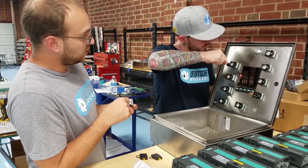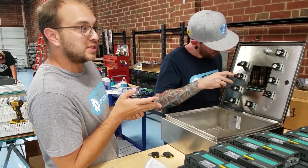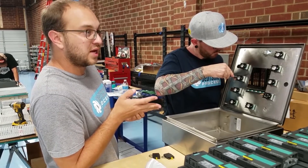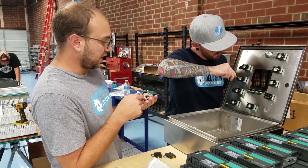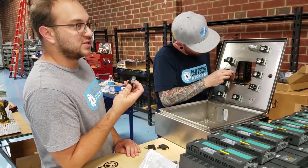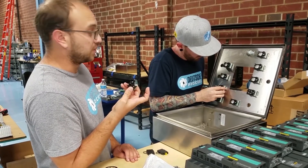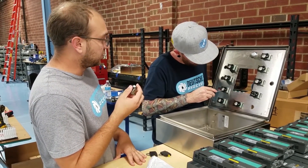The second benefit is you really don't have to key it. With some buttons, you actually have to get a nibbler and key it to know where the center is. But this thing right here actually has a little dot — basically a point that just grabs into the stainless and holds it in place. We've really never had one move on us like some of the other competitors.